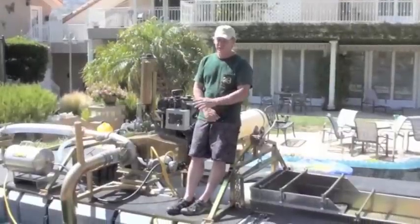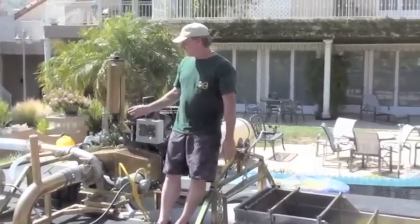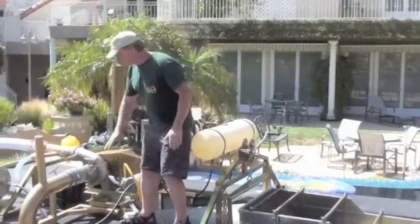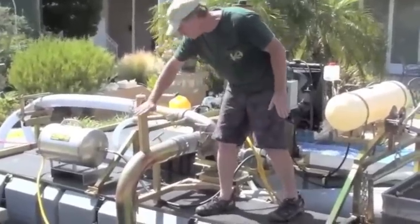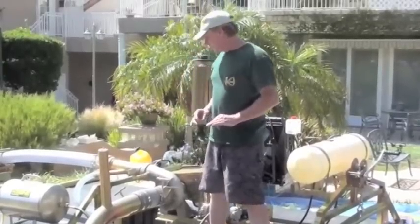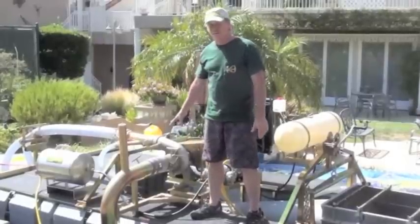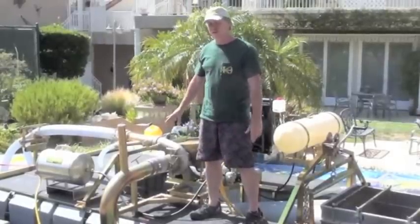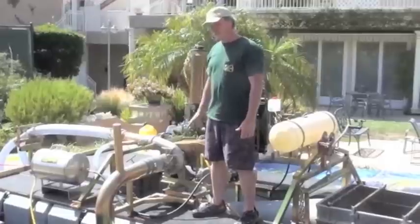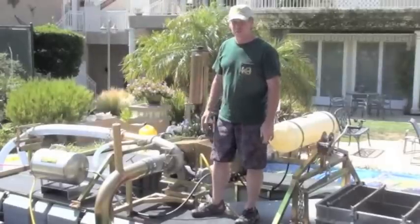Before I get into full operation, I want to explain some of the basic plumbing on the machine. The most important thing we just went through quickly was the priming. When I talk about priming, I mean having this entire system flooded with water. That means the pump is completely filled with water before you start the engine. If you don't pre-prime the pump, you're running it dry, and if you run this pump without water for more than a couple minutes, there's a chance you can shorten the life of your pump seal. It is a replaceable part, but you don't want to deal with it if you don't have to. Always make a habit of having the entire system flooded with water before you ever start your engine.